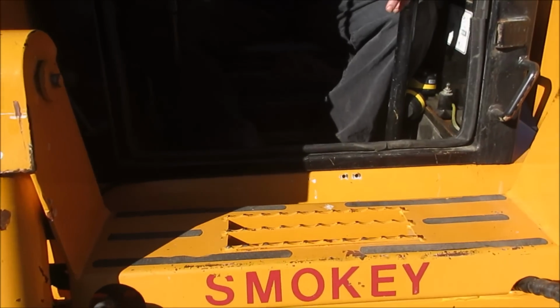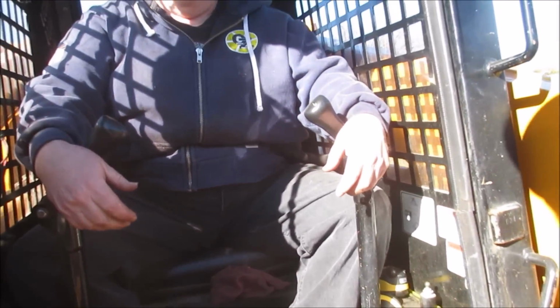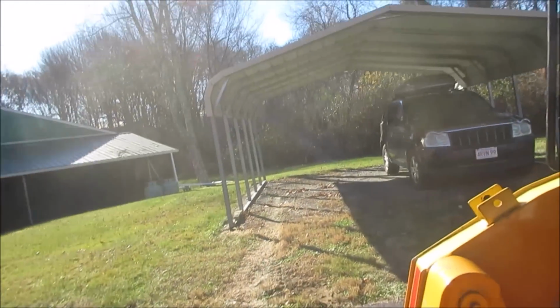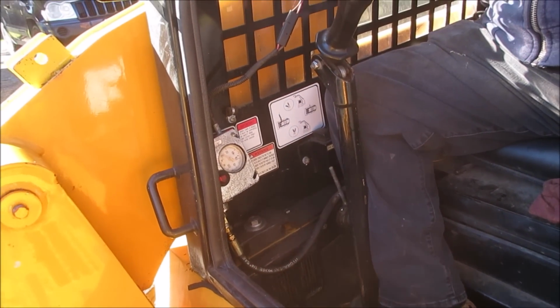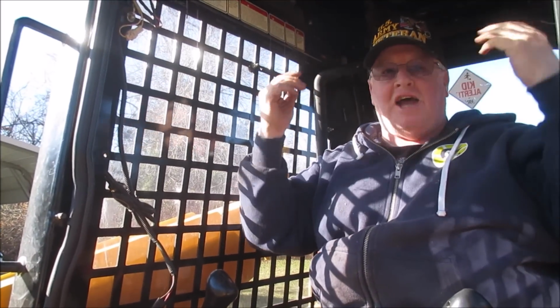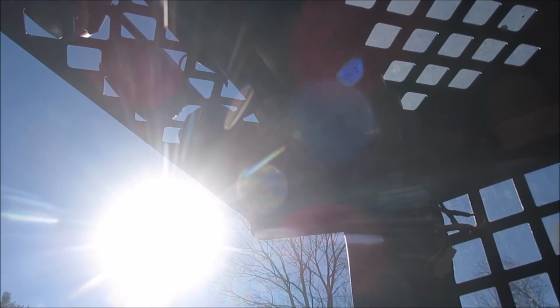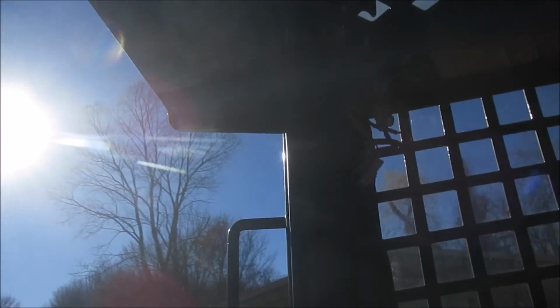You want a tutorial and go over it? Yeah, if you would, just give me a couple quick how-to's. Safety bar. Does nothing without it. It'll spin. It'll try to start, but it won't fire over. It's got main power here. You can hear it clink, and then this is the ignition. But it won't start because this is without the bar down. If you put the bar up and get off the seat, does it die? It'll shut off. It'll kill it.